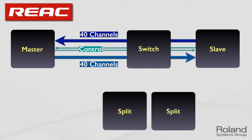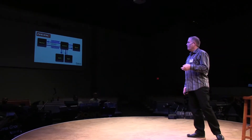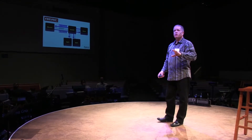For other devices that hang off the network, they are called splits. You can have as many splits as you want — it's like a listening post that just replicates and sends all of those outputs. It's all possible with just an Ethernet switch. We make a switch with EtherCon connectors — not a plastic box with a wall wart. You can split out hundreds of times if you want, and every split on the system will receive the audio.